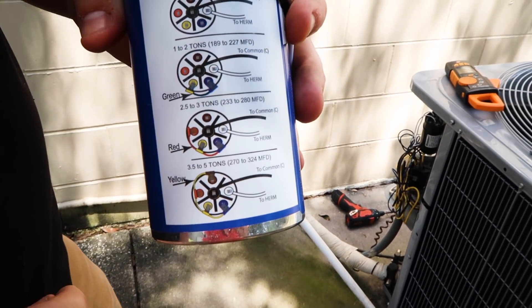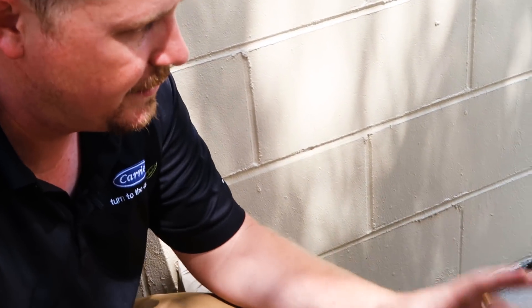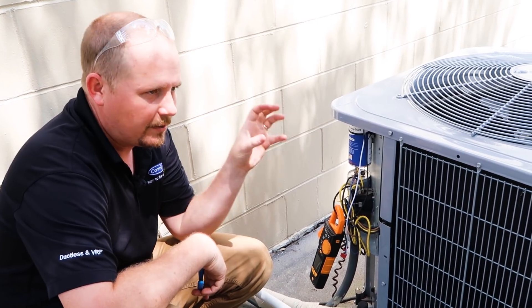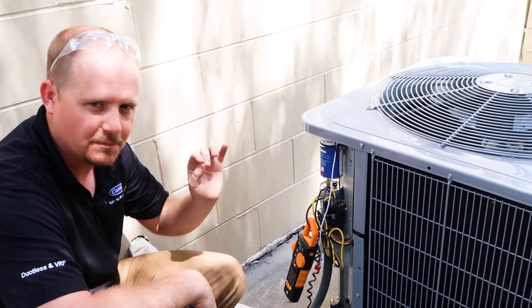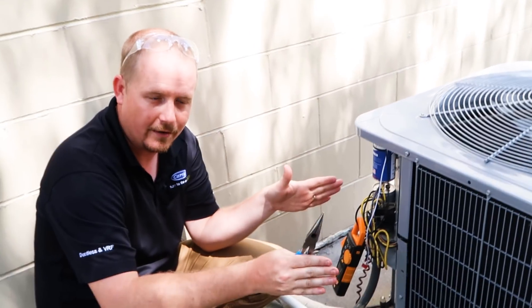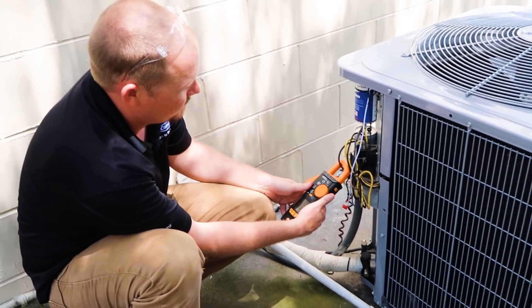It's very similar to some other products on the market. Before we wire this in, I want to take an inrush amp reading without it in place and see what type of inrush amps we get before and after we connect it. A key thing is that when you have a compressor at locked rotor, what we're measuring with inrush amps is measured over a period of time because your meter isn't quick enough to measure that very first split second. That first split second is dictated by the compressor winding and there's nothing a start capacitor can do with it. What a start capacitor can do is speed up that initial starting period to get the compressor up to speed faster through a larger phase shift, and we'll see that represented in the amperages. So first we're going to go ahead and do an inrush amps reading without.